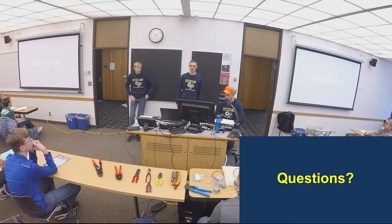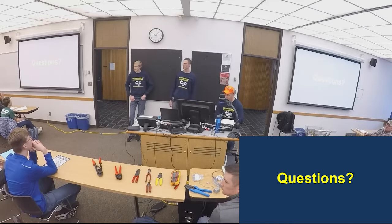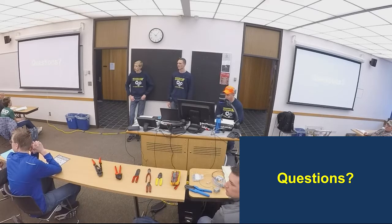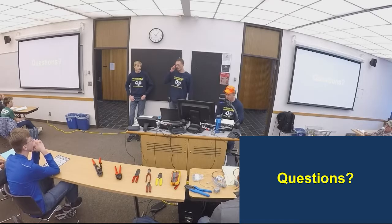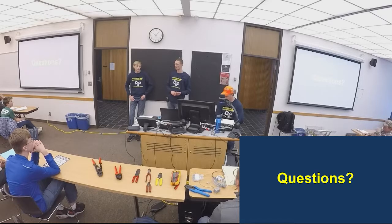Do you have any questions? Yeah. What would you say are the major advantages to using CAN over PWM? Probably just you don't have to route wires back and forth, and typically the motor controllers with CAN, like the Talon SRX, just have more capabilities. What are any disadvantages of CAN? I can't really think of any.